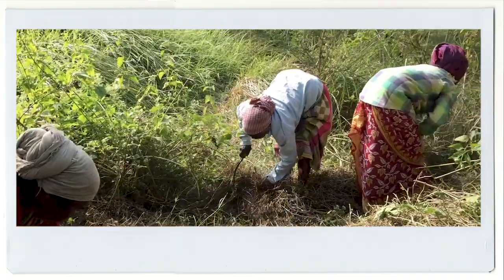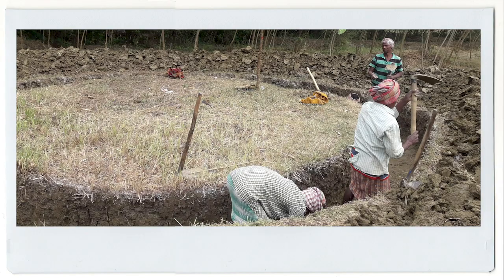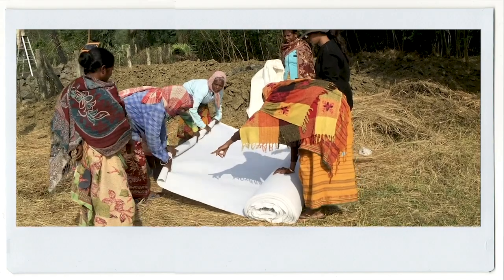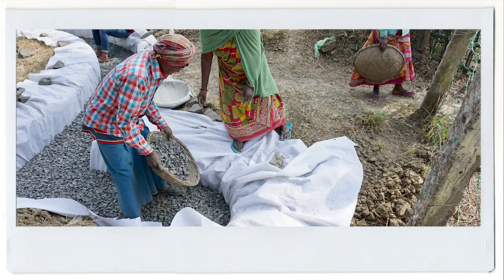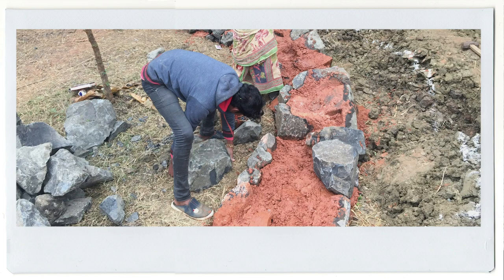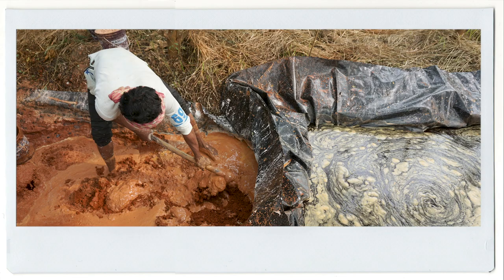We started with a traditional ceremony to bless the building site in keeping with local tradition. Then we cleared the land, marked and started digging our pie-shaped foundation. To ensure that no moisture seeps in through the stone rubble foundation, we used a layer of geotextile to wrap around it. Then we built our plinth using rocks from a local quarry, bound using a traditional mortar made using surki, which is a powder made of crushed bricks fermented with lime and jaggery.